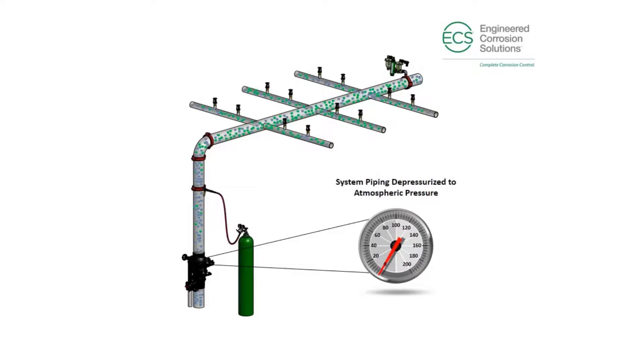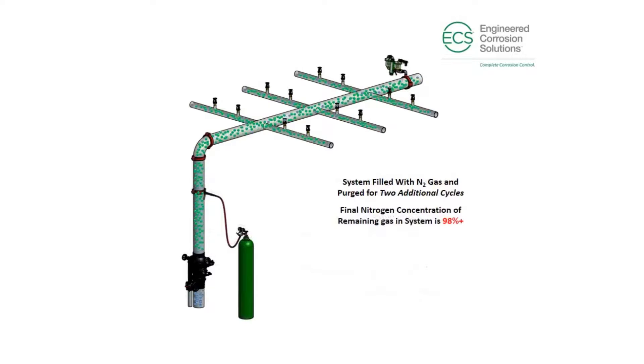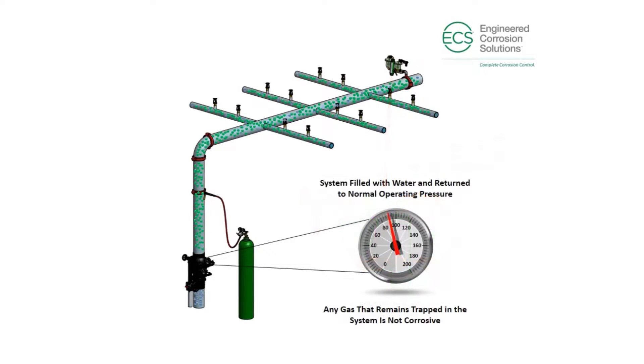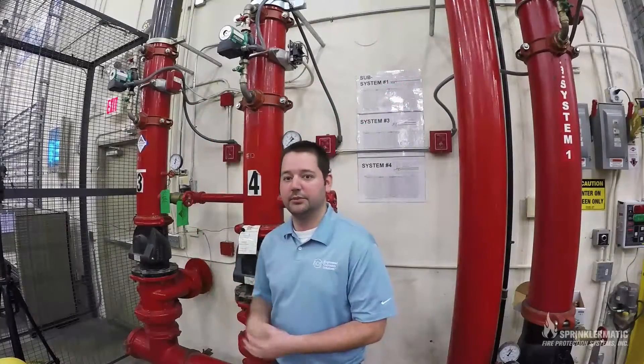So we'll drain all the way back down to zero, fill it up one more time to 30 psi, and then take another reading. At that point, if we're above 98%, we're good, and we can return the system back to service after we drain the nitrogen. A lot of times, though, we'll take three fills. If we're not at 98% or greater after the second fill, we'll require one more fill. After the third fill, we should easily be above 98%, at which point we'll drain the nitrogen and return the system back to service.